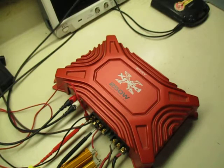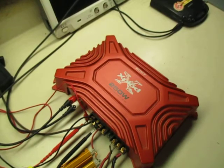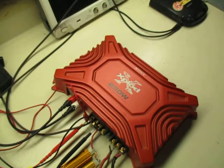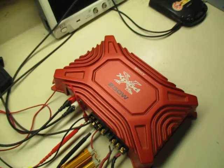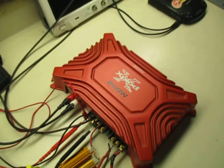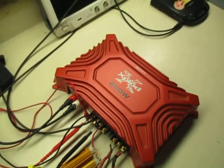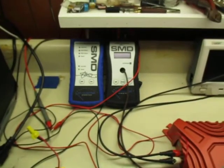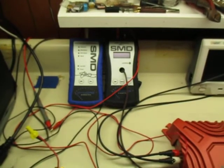On my last video, I tested this Sony amplifier on a 40 hertz continuous sine wave, and I ran that test, and then I kind of got in a hurry and wrapped it up. I forgot to do my dynamic power test. So it got 154 on the continuous test and 162 at clipping on the continuous, which was not near to 250.